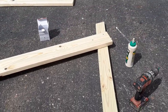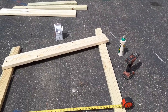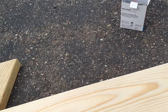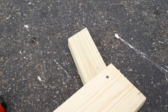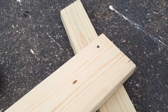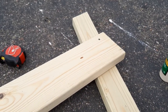You want to measure and make sure you have the same distance all the way up those legs. Depending on where you put that screw, it should be about 37 and 5/8 all the way along the length of those legs. Mine came out to 37 and a half — the distance between there and there all the way along. That's fine — it just means I'm an eighth inch off, which is fine. We're not landing a rover on Mars, we're building a beehive. Once I've got it even, the distance between the front leg and back leg even all the way along, I'm going to put the last two screws in.